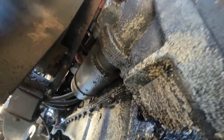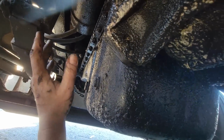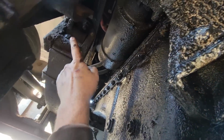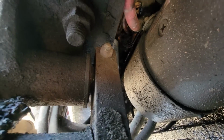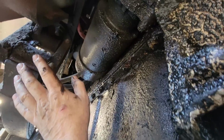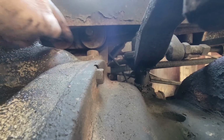I put that on the outside, but I need to inspect everything real good to see what we need to do on the front end, because the time to do that work is when the engine's out, because it's a lot easier to get to everything. I imagine that mount might need replaced. That's dry, and that is not good. Look how dry that is compared to this one. Like, it wouldn't take grease apparently. All they had to do is jack up the frame just a little bit, take some weight off it. It probably would have taken grease. This side, transmission mounts equally as bad. I know I've got the camera twisted all over here, but it's hard for me to see and do this. But those will need replaced too.